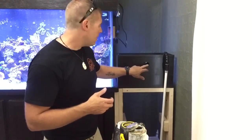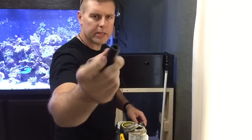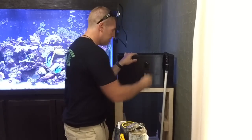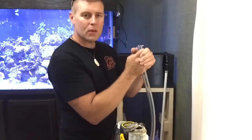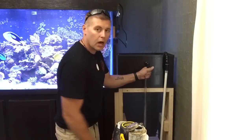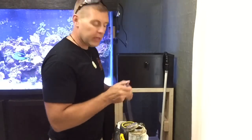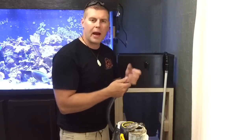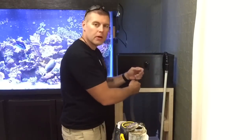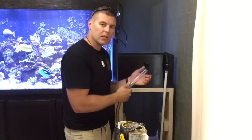In the kit I got, it comes with a 90. We're going to glue this in here with the one inch pipe — and then we connect the overflow pipe onto that. One key tip: if you really want to get the clear pipe softened up, take boiling hot water and soak the pipe in it. Let it get really malleable and then slide it over your connection — it'll make a really tight seal. You can also add clamps, but softening the pipe first makes everything a lot easier.